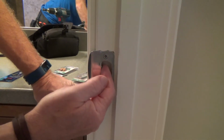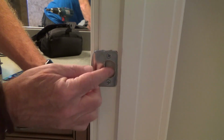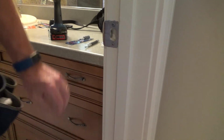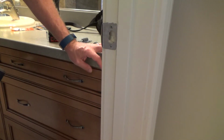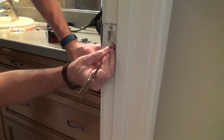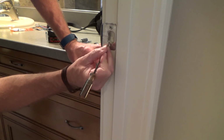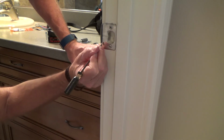But the door is not sloppy in here because I've already adjusted the latch tab. So what does that tell me? It tells me that I still have to keep going in here, and once I do that, I might end up having to shave this little edge from here over to there, more so than this curve. So this is probably the part I have to grind on, and it might be low enough right now. I'm looking at this line.